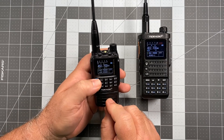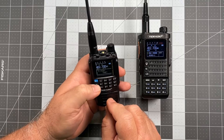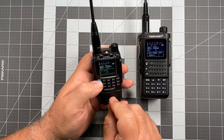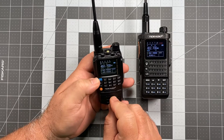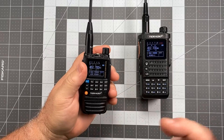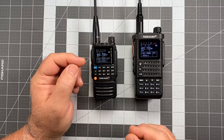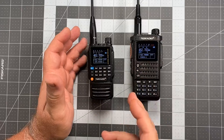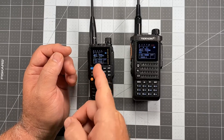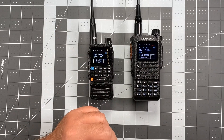Let me show you how you should have your set up. I'm going to go here and select — so that was tone two and tone one. Your third selection is off. You're going to click that button and click exit. And now here's what you hear — you hear nothing. That's the sound of silence, because it's sending neither a little jiggly tone nor a little burst of static. But if you do have one of those people that says their TDH3 does that squelch tail thing on simplex, chances are very good that they actually have that Roger beep set to tone two, and that's why it's making that noise. It's completely unrelated to the other issue.